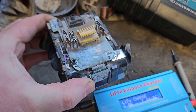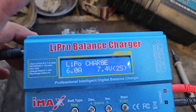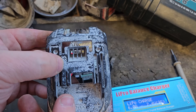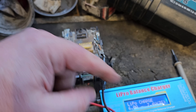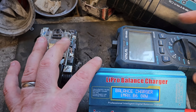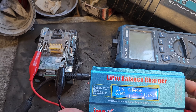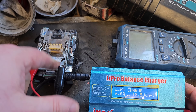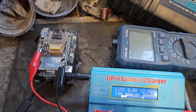You wouldn't want them down that low usually — 3.5V is as low as you'd probably want them. They've got down to 2.5V, but they're all balanced and all good. If you have a battery like this, you have two choices: you can use a LiPro balance charger, or you can use a power supply to bring up the voltage. I'll set it for 5S — that's five series of cells, which is an 18V or 20V battery — and we'll just set it to charge that up.